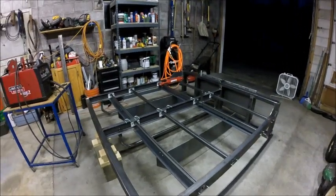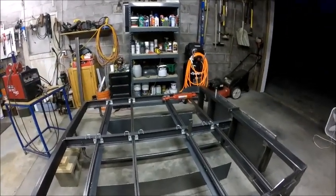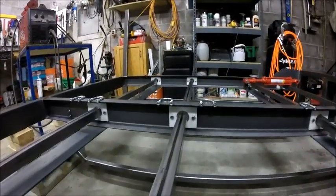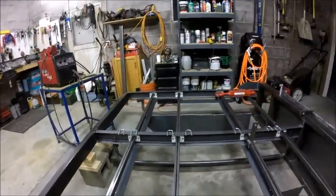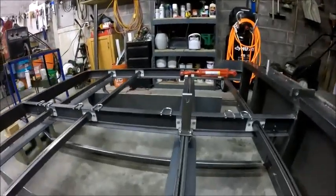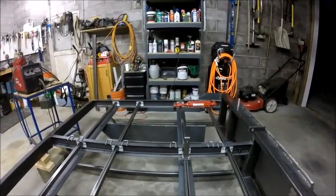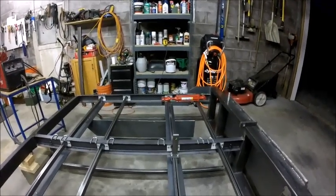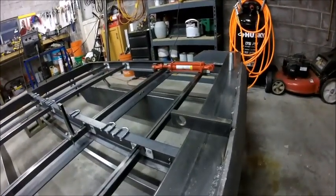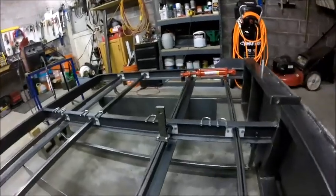Good morning, everybody. Here we are — we are going to start fabricating the linkage assembly for the actuator. As you can see, I got my Delrin in yesterday and got all the bearings made. Shafts are installed so I can get my height. I tacked that guy on there just to see how off my elevation was. I'm going to weld this male clevis end on and put the pin in, level the cylinder, and I will get my elevation for the rest of the assembly.